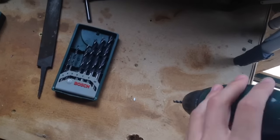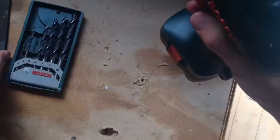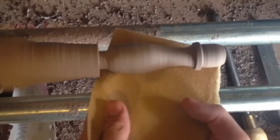This is why it's great having a workbench you don't care about too much. I just got a drill bit and was testing holes to see what kind of fit the chisel best. Once I did that, with the lathe off, I started drilling into the piece of wood and turning it with my hand to try and keep everything centered.